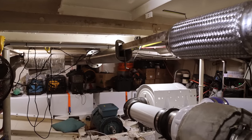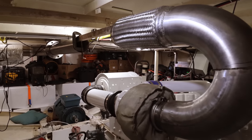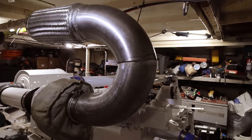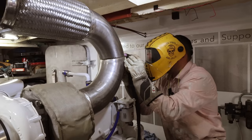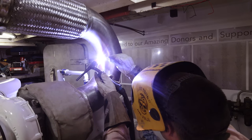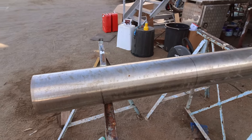This is the rig we've got holding everything together - a piece of wood clamped to the top of the original exhaust, which is bolted with a gasket to the flange. That's supporting the top of the flex joint, which is also supporting the very front joint we need to tack together. We're going to tack it in place where it is right now, then take everything off and weld it out on the bench. Now that we've got that tacked together, we can start working on the straight section that goes between the two of them.